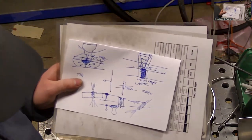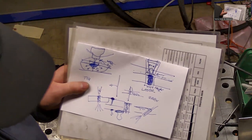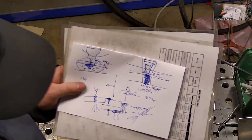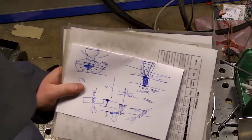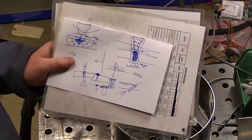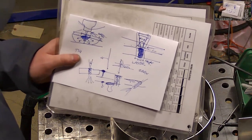Yeah, you're saying even if you're doing wire welding, you would not bevel before making a weld. You'd still have the two pieces flat against each other, and the wire just fills up some of the cratering. Yep, yep. Because you can get quarter inch penetration with this, no problem. You don't need the beveling.